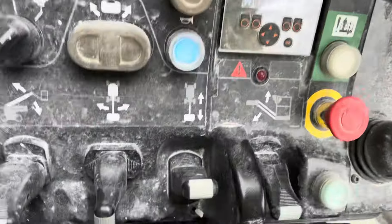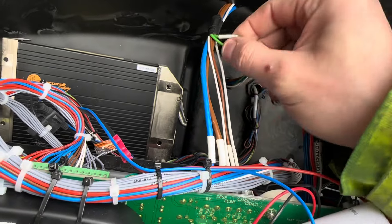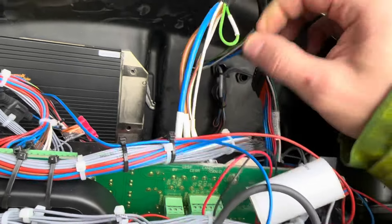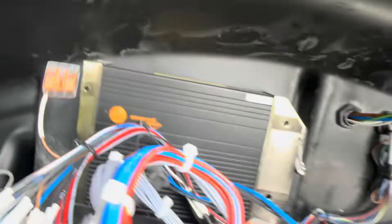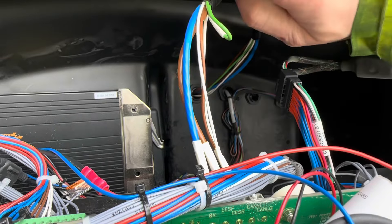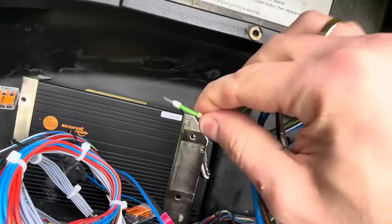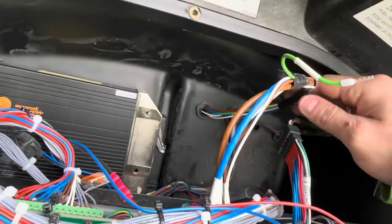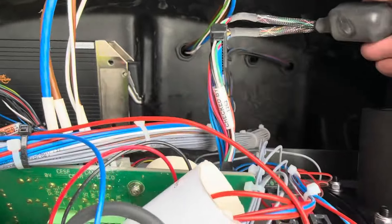All the wiring seems to be okay. The only thing I would note is that this green wire has to be connected to the shield - it says 'shield wire' and that one is a shield as well, so these should be connected together. For some reason it's been taped up, but we can fix that by pulling it out and loosening the green wire so it can be connected. I think that's not a major issue - the main issue is with this adapter.